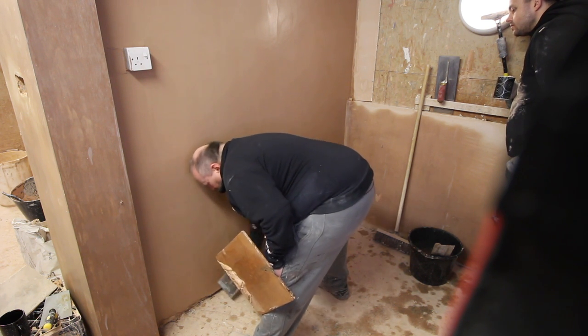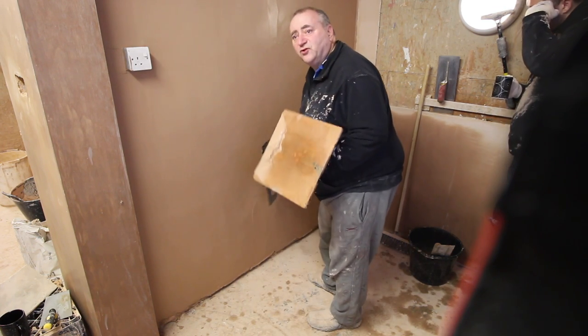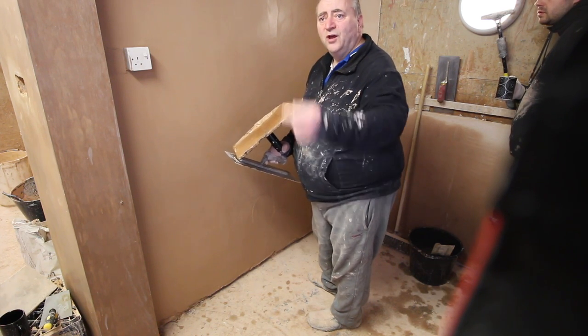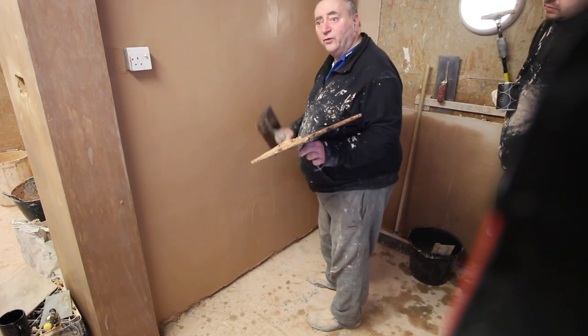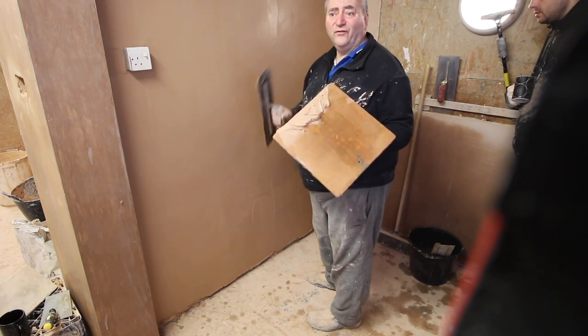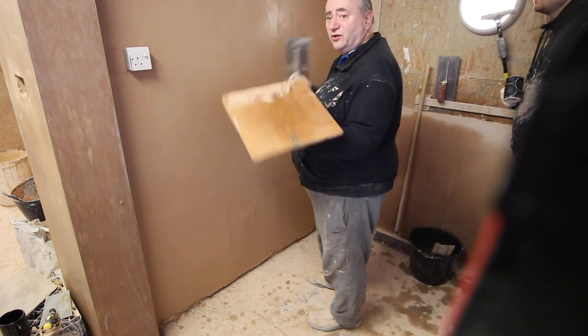These bits tend to be the joints between the trowel. You tend to leave wee bits like that, so you've just got to try and get that trowel firm to fill up. The longer I leave that, this stuff's firming up and it wouldn't fill much up. So you basically just want to get your two coats on, trowel it flat right away, and it's under control. Clean your pail obviously first, then trowel it flat.